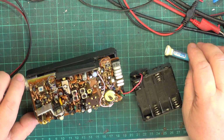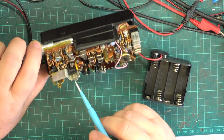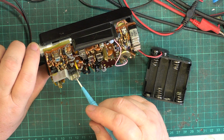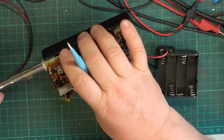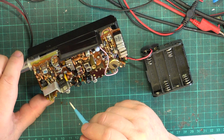So we're going to have to look at that circuit to find our way around this. We've got a 2SC2078 output transistor, so we know the PA is capable of 4 watts, which means that if it's doing 2 watts, having a telescopic aerial isn't going to be a perfect SWR, so it's a pretty bulletproof PA.